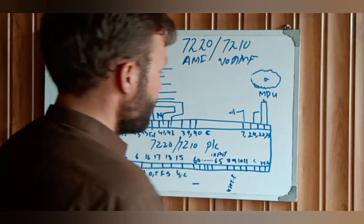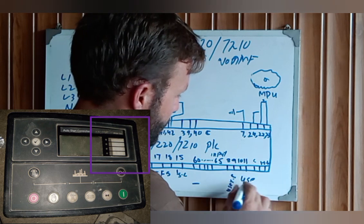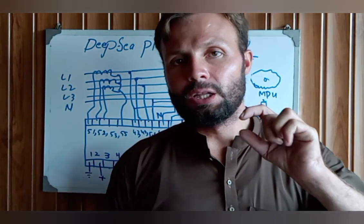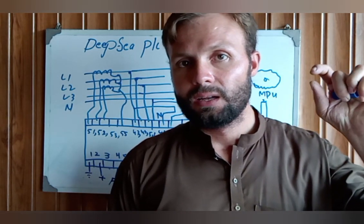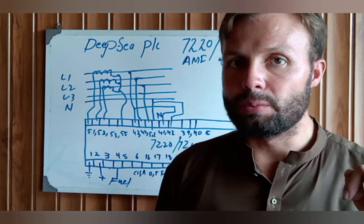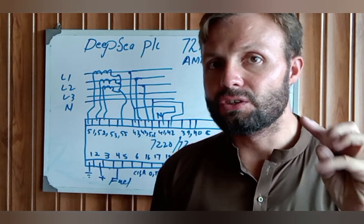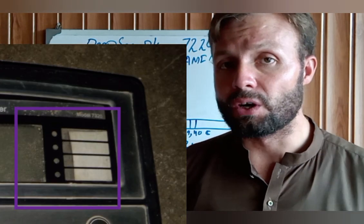Pins 8 through 11 are user-configurable warning output LEDs. When you have low oil pressure, the module will light up the corresponding indicator light to notify you. If the engine is over temperature, the over-temperature light will come on. This module has four indication lights that you can program and use for different warning purposes.